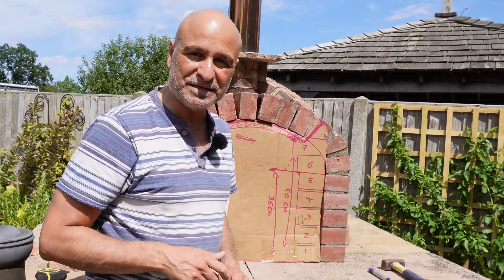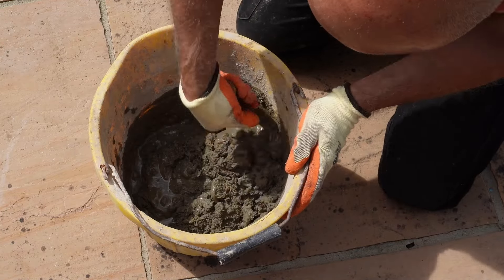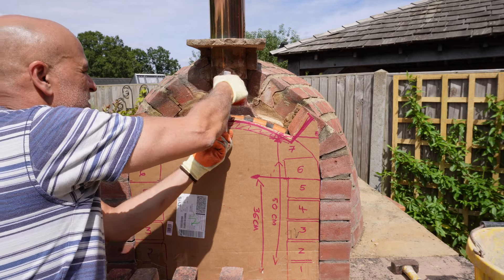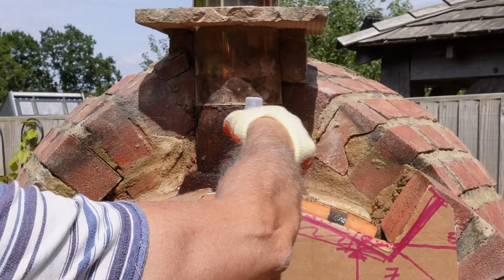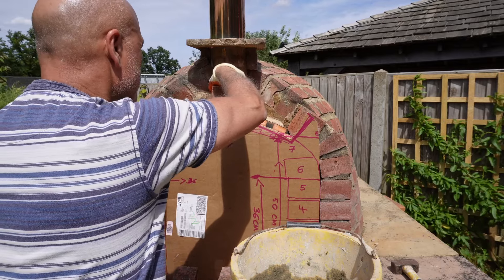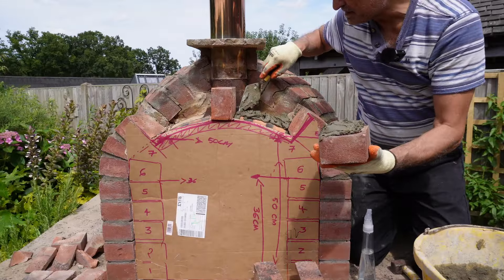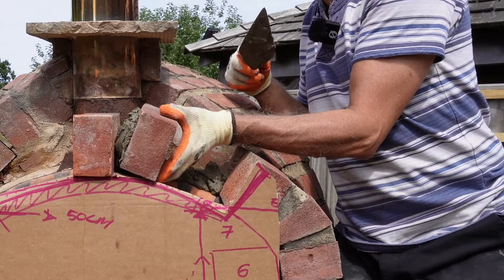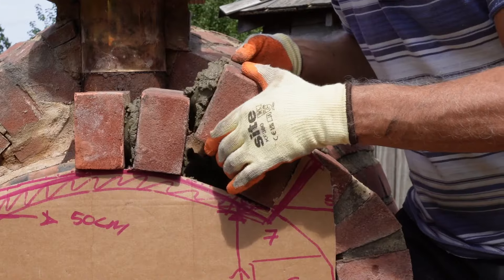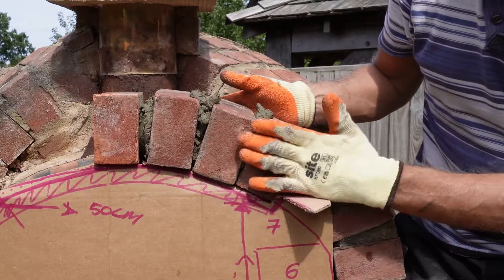Here is my sand and cement. It is a very warm day so I want to make sure it's not too liquidy, but equally it needs to be dense enough to hold my bricks. As it is a very warm day I will be spraying some water, otherwise the cement will dry too quickly and crack. I start with the very middle brick. I've decided to move up here so that I can see better and also reach easier. The bricks will be held by the cement I'm placing, but also by the cement in between which I'll do before I place the bricks on. I have to take this one out as I put it the wrong way around.